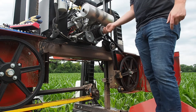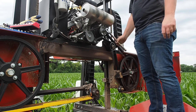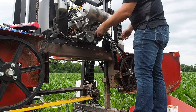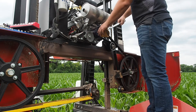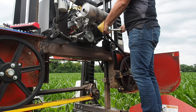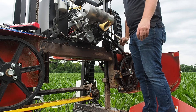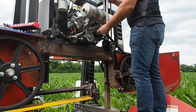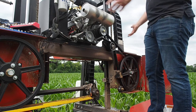This is the magic nut that we're after. Like I said, it's a 15/16ths. And you'll see what I was running into yesterday — it just turns. So we'll take our leather glove, jam it in there at the 10 o'clock position. There we go — she's stuck in there. I'm already set at 45 foot-pounds, and we're hitting the torque. So we're still good on torque. Now I have to get that out of there — I'll just reverse it. Out we go. So at 10 hours, I know that my clutch bolt's still in good shape. Now I can put this all back on.